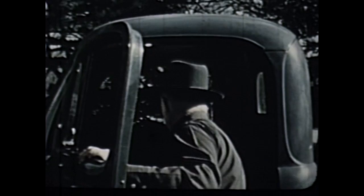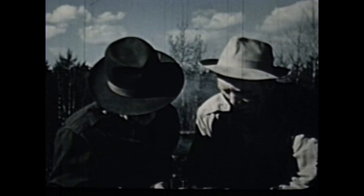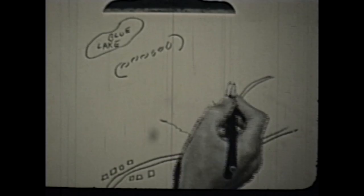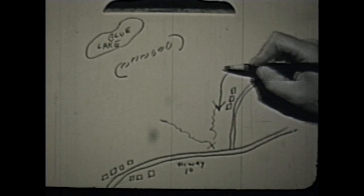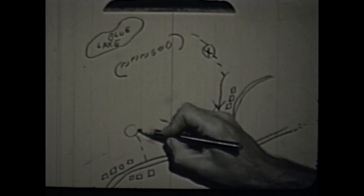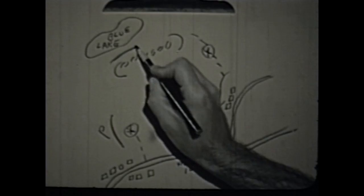'How's it going, Joe?' 'It's a hot one, Bert. It started down here and it's moving up the mountain, fanning out in both directions. We're doing our best to hold the flanks and keep it away from town and the summer cabins, but we need help bad.' When the truck gets here, we'll send it up to the mountain stream and run out hose to hold the east flank — we'll put in a relay if we have to. A slip-on unit is coming to back up my crew. I'll see if I can get another truck and a plow from Warren to the west flank. Our best bet to stop the head is to have Foster's crew build a line on the summit. Here comes the truck.